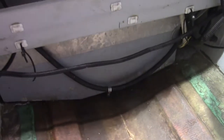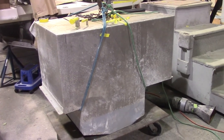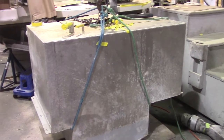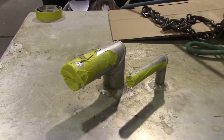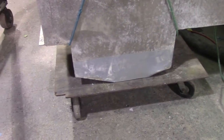We'll have to remove the tank as well, but we'll have to do this in sections so we don't lose the shape. We got the fuel tank out — it's 124 imperial gallons, and if you multiply by about 1.2 that gives you US gallons. It didn't come out that smoothly — one issue was the fill spout was a little bit high and we had to do some cutting inside. The other problem was it was hitting the motor mounts, so we had to trim those off a little bit.